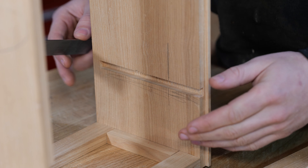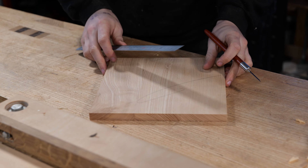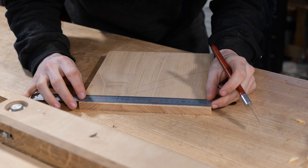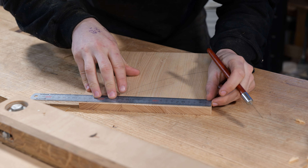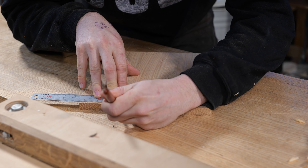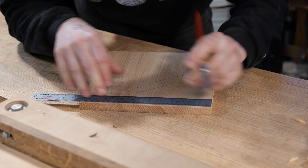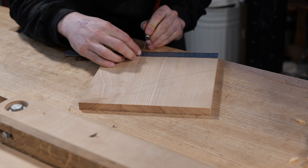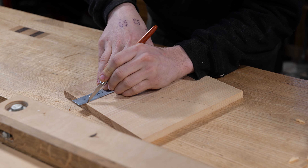Adding that millimeter means we can plane a bit of excess off the front after assembly. I stupidly threw away the panel gauge I made in the first part of this series, which would have been ideal to scribe this parallel line, but seeing as we're making it oversized I can probably just get away with doing it with a knife. So we're marking it one millimeter oversized and I'm going to do exactly the same down this side and then join them up.